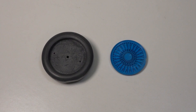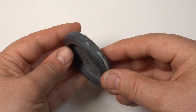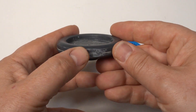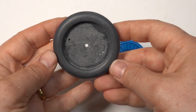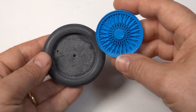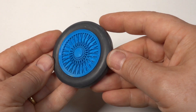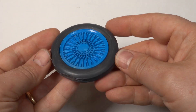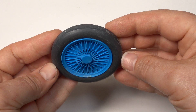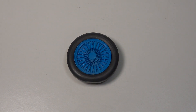The six wheels were also cleaned up and glued together. The seam was filled with milliput and a flat was filed on each of the tyres. The spoke unit just pushes into place and is a really good fit. I drilled a couple of small holes in the back of the wheel to help push out the spoke unit just in case it got stuck in the tyre. I'll be able to paint these separately from the tyres. I'm really happy with this technique for making the wheels and I'll use it again — well, you'll just have to wait and see.